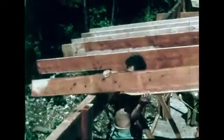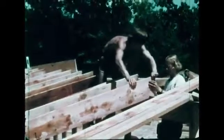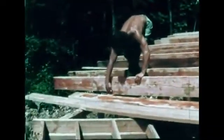The lower ends of the rafters are notched and nailed to the wall top plate. These rafters run to the top of the crow's nest walls, where they are also notched and nailed. Usually, rafters in any section of a roof are evenly spaced and parallel.